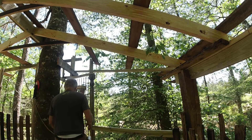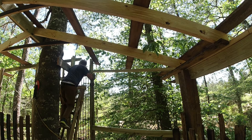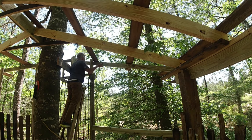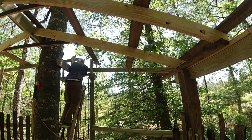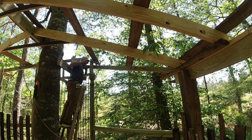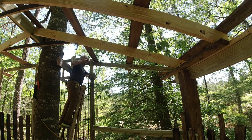So all that talk in the last clip about how I was going to do it is not how I did it. There's a vertical two-by-four about a foot tall — it's an extension of that column, going straight up in the air. This is a twelve-foot treated two-by-four, so it's not heavy, but it's too heavy to hold out in mid-air while messing around with a clamp or screw gun. So there's a five-quarters by six to my left — a temporary board that sticks out past the overhang — so I have something to rest that two-by-four rafter on while I'm getting situated.